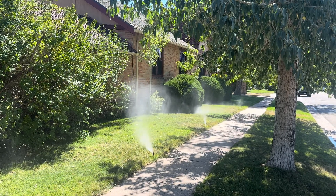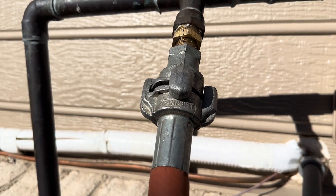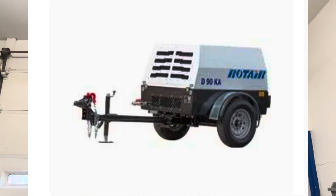How much CFM do you need from a tow-behind? You'll see units rated at 90, 185, 225, 285, or 500 CFM. For residential blowouts — even renting one for the day — you don't need 250 CFM; you barely need 185. An 85 CFM unit would be fine for most homes. For commercial or large locations you may need more — I've had to run two large compressors simultaneously, one at 185 and one at 225 CFM. But generally, 85–185 CFM on a tow-behind covers 99% of homes and even most commercial accounts.